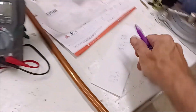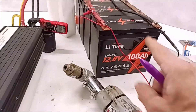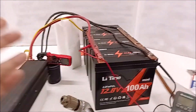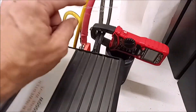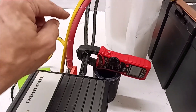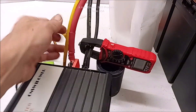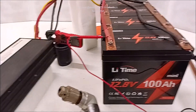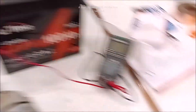Here's the story about them. She's been writing down her top charge and bottom charge before shutoffs. This still has lots left to go. But these right here were just handling nearly 300 amps — actually, if you consider surges, way over 350 amp surge, because it's going through a Sweet Power. This cable was getting hot, and it's two gauge — short two gauge — and it was getting very warm. So we had to add a little four gauge, old piece of jumper cable to it.